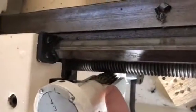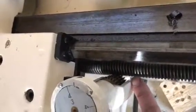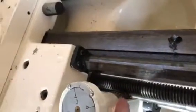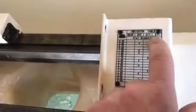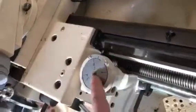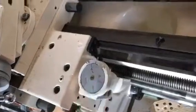But in my one turn over, I have three gears and from the top I have 25, followed by 24, and then 22. I confirmed this by writing it down: 25, 24, and 22. So I'd like to know if you have the same, and if so, how to set them up — whether this should be 25, 24, and 22, or maybe my indicator is from a different lathe.